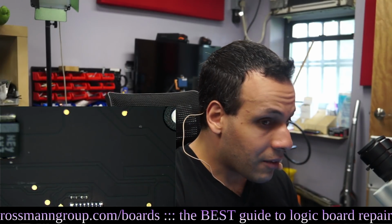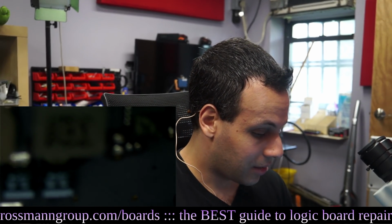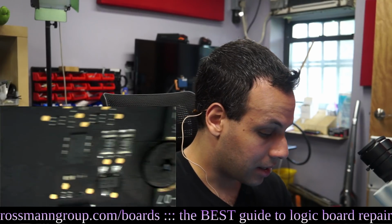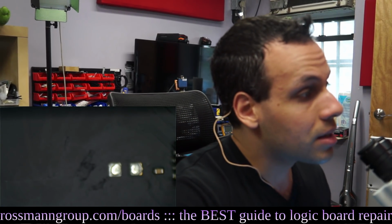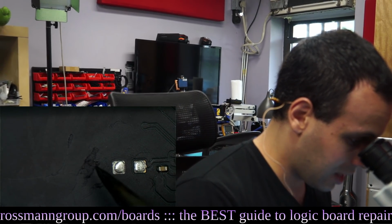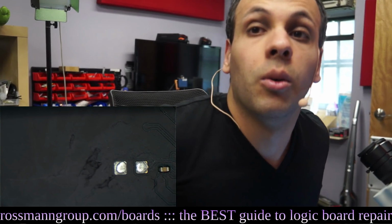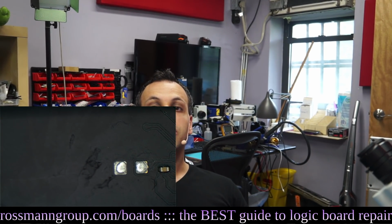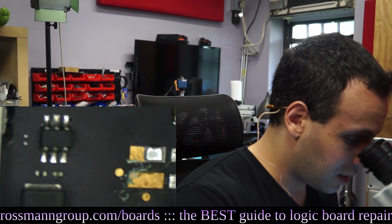Good question. When you have a board that turns on but doesn't have a brain, the issue is usually something with some kind of gunk. Let me show you what I mean. All right, so see this? Do you see how there's that kind of thin layer over here? See this stuff? Now that looks innocuous to you, but if something like that gets underneath the CPU, it stops the communication from working properly, and it'll cause the no-brain thing that you're seeing right now.